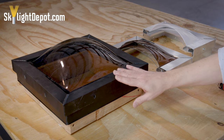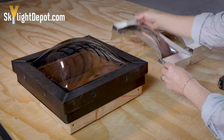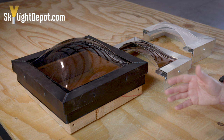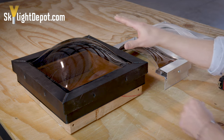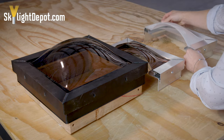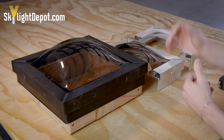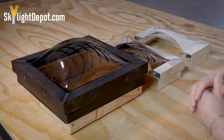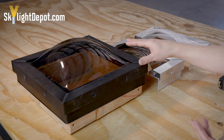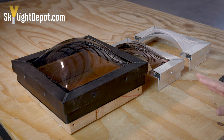It's really about matching the colors on your roof. If you can see the skylight from the ground, the bronze anodized looks great; if no one ever sees it, the mill finish frame should work great for your project. This particular frame is a bronze frame with a bronze over clear double dome. You could also do a mill finish frame with a bronze over clear dome, a mill finish frame with a white over clear dome, a bronze frame clear over clear, or mill finish frame clear over clear. In the majority of skylights, the white is on the outside and the clear is on the inside, but you can reverse it. We do see clear over white, and very rare exceptions of white over white or a bronze dome over a white inner dome. We can do whatever you need as far as the color of the plastic.